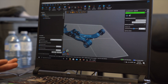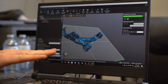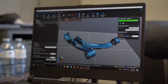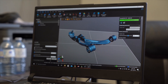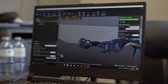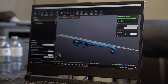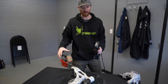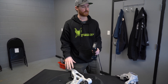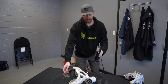Now that we can see the arm by itself, I just need to flip it. The scanner picks up the targets I've left on the arm — when I flip it, it'll automatically align them and merge the two scans together. I've left the targets on the arm and removed the ones on the table, so the table targets become a new reference in relation to the arm targets. If it picks up the targets on the sides, it'll automatically realize they line up with the existing ones and flip it.